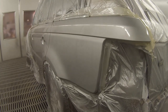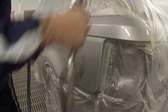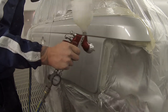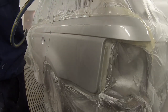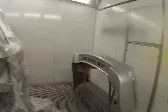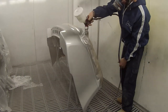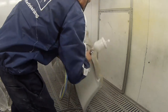Spray painting is one of those things where I might do it differently than the next person — just get something that you feel comfortable with. Although it is good to follow some of the basic guidelines with your pressures and your fluid settings. If I was using the transtec or the conventional cap — if this was not HVLP — I would set the gun up slightly different. I would still leave the fluid at about the same setting, yet you might want to put the pressure up a little bit. Because with HVLP you can use a little lower pressure and still get a good finish. With a transtec cap you might want to jack the pressure up just until it feels like it's coming out nicely. You can see I'm adjusting the pressure as I go sometimes.